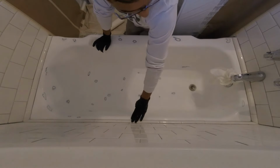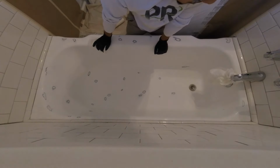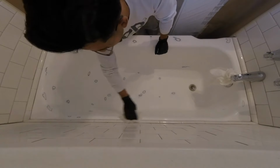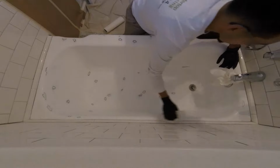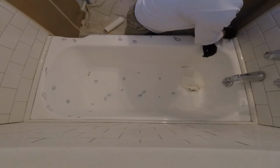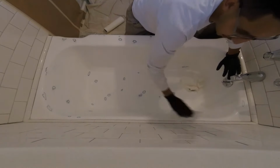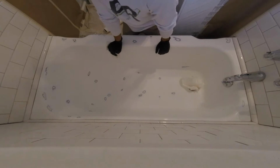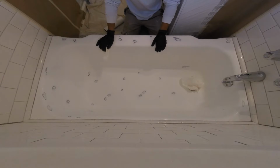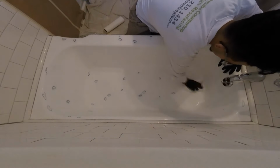There'll be, like, this is perfect, like I said. Did a good job here, but there'll be some parts with silicone or anything that's related to the latex. Remove it. Make us know too, make the boss know, because we will charge for that. Silicone does not get along with us. It's paintable, but as soon as it's dry and everything, you push it, you will hear cracks, and that means the paint is not sticking. And that's where the chips and everything starts, and that's where our warranty will not cover if it's already been silicone with it. You can use silicone on our product, but it has to be after we're there. And that's not our choice, that's the resident or the tenant's choice.